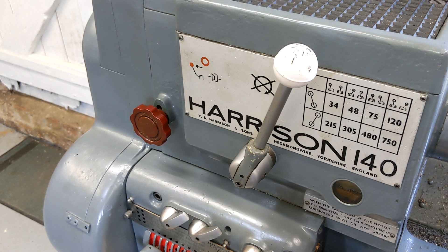Another clue to a hydraulic locking problem was when I turned the red knob anti-clockwise under pressure against the resistance, oil would come out of the hole directly above. The hole contains the spring and the ball bearing which indexes the reverser shaft.